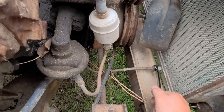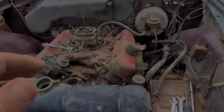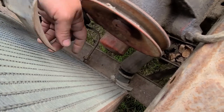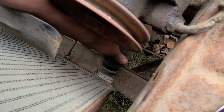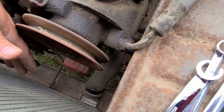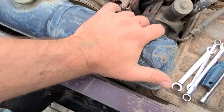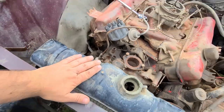The fitting is turning inside the radiator as well, so I had to get another wrench — more of a two-handed job to get those lines off. But they both came off nice, threads are still good. While I was down there I got the transmission lines off, also got the clamp off the lower rad hose and it moves — it's a little tight because it goes right into the water pump, only about eight inches long. Now we're just going to get in here and take off the four bolts holding the radiator in. The support is actually part of the radiator, so pull all four bolts out and hopefully this will slide right out of there.